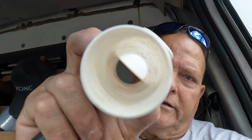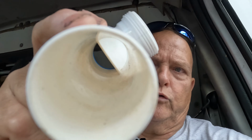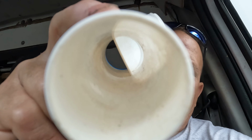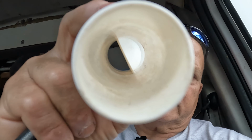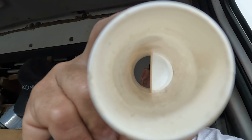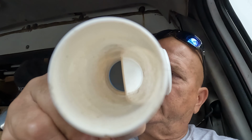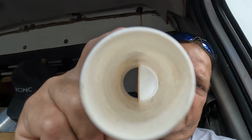That's wrong. And if you don't have that baffle, if you're going to say, well, I don't use the ones with the baffle, well, then you're going to get discharge from the disposal up into the basket next to it, the bowl next to it. So that's why I do it. This is a stoppage point. If somebody abuses it, which they do, 90% of people using garbage disposals put way too much in at one time. But this is where it's going to stop up, guys.